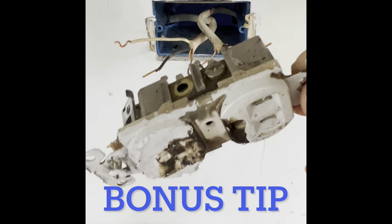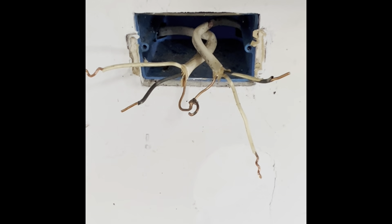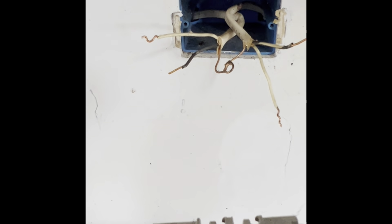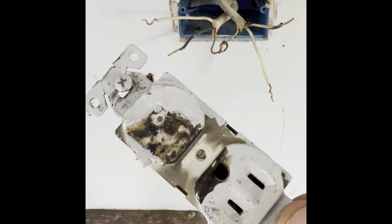It is going to require a little bit more work on the inside though. This outlet is burned and melted to crap. When I took it out, they had the two white wires tied together and the two black wires going to either side — they were trying to use this 110 duplex receptacle as a 220 duplex receptacle. Some people should not be allowed to breathe.